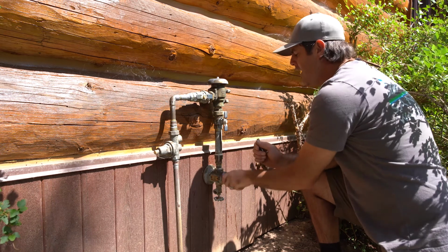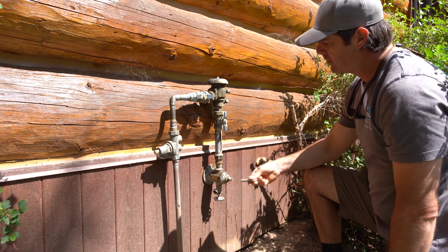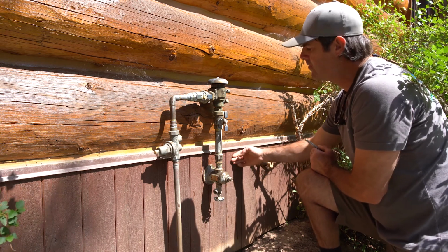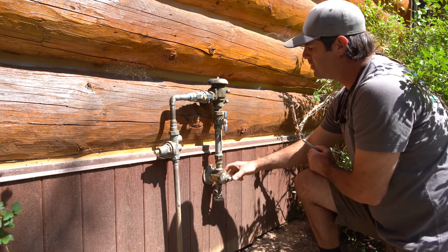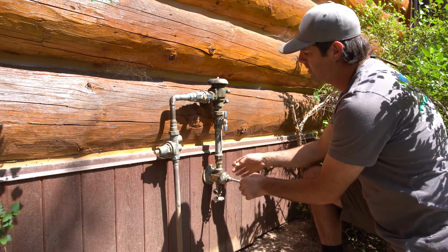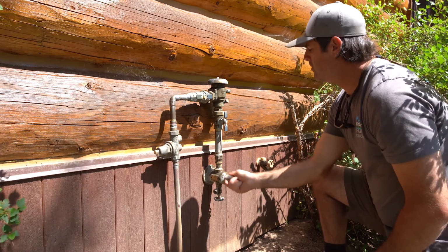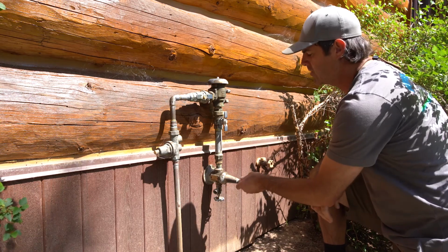On the inside of this cone is a rod that we're grabbing the end of with this key, okay? This rod actually extends inside past that frost point, and we're doing that shut off on the far end of it there. So this rod is extending all the way in, and we're actually turning that to turn it off on the inside. So it's very counterintuitive here as well. Since it is on the inside that we're essentially closing, it's backwards out here as we're turning it.